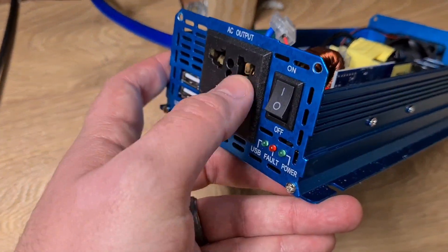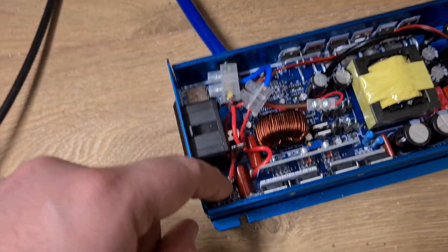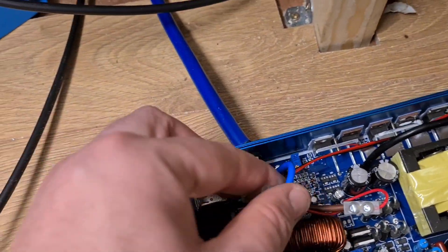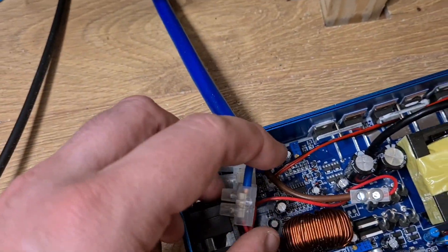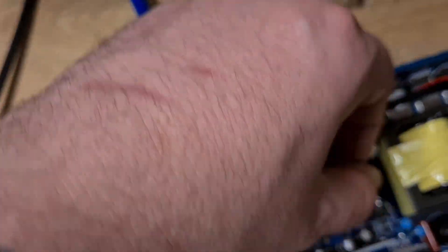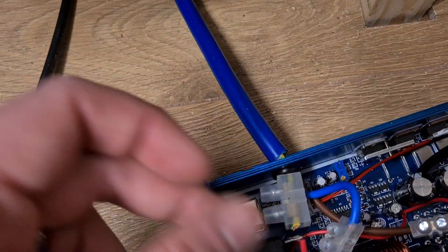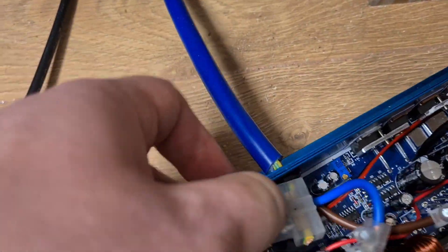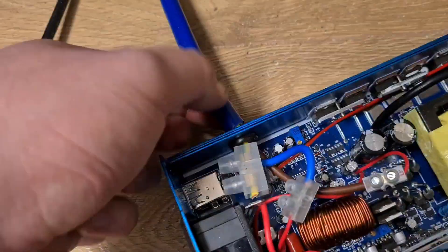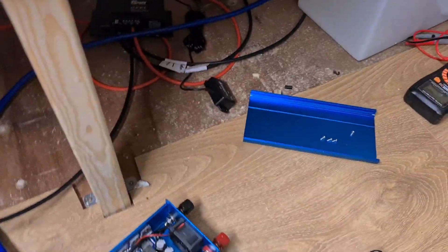The cable comes around and goes into your inverter. Your inverter has a lovely little on-off switch that we're going to utilise. Take one of the cables from the on-off switch — just one of them, there should be two, obviously only take one — and cut it in half. Wire the two different cores going from the fridge thermostat switch lives to each side of that cable you've cut. You have to drill a little hole in your inverter and put a little rubber grommet in there to stop the cable being cut, and then you can put the little top back on.